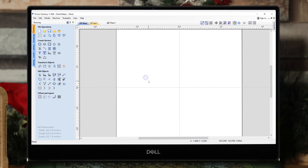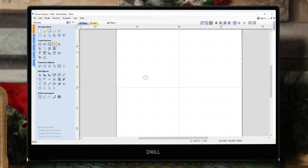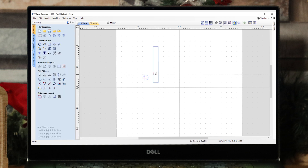Knowing that, we can now set up channels that are going to be a quarter inch wide. We'll use our grid setup in the software — turning on the grid and going up to Edit, then Snap Options. Right now our grid spacing is a quarter inch, which is exactly what we need to create the channels for our maze. Let's click OK, grab our rectangle tool, draw a square rectangle that automatically snaps to the grid, and you'll see that the four millimeter ball bearing will travel along inside that channel without any problem.